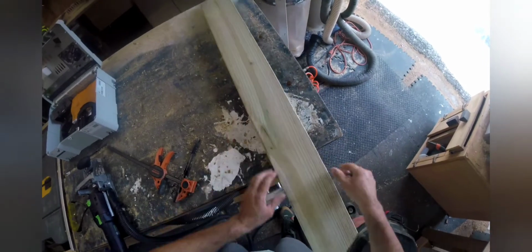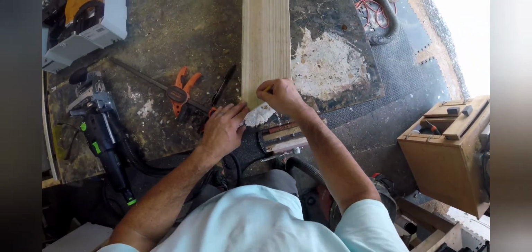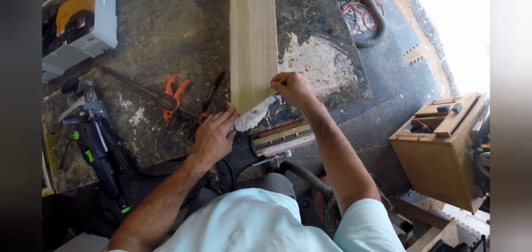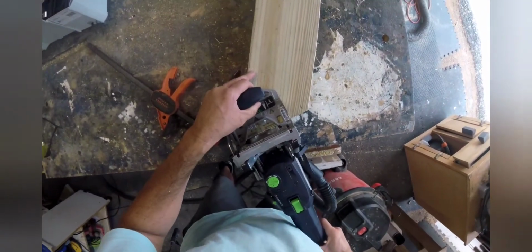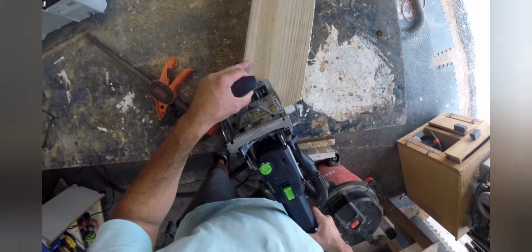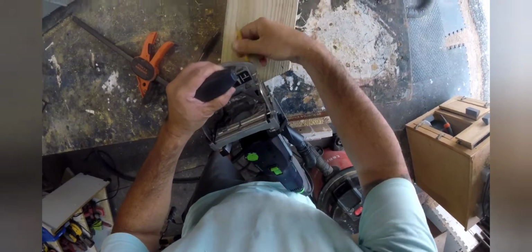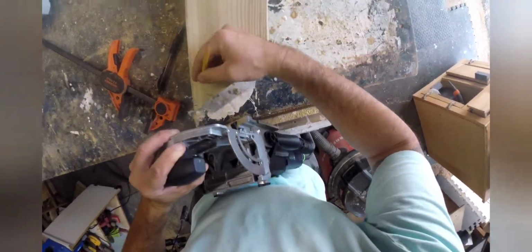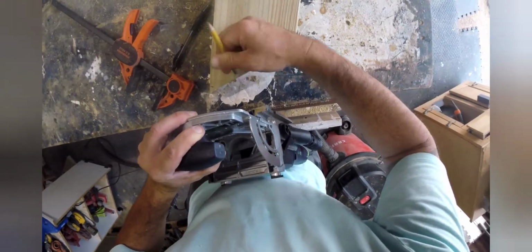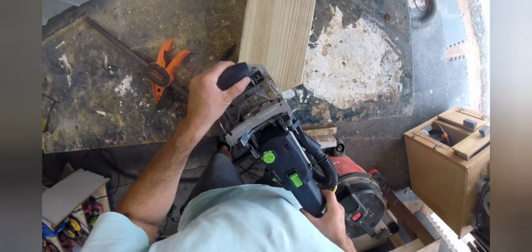I did forget to video this part as I assembled it later. I'm just going to put the dominoes in. I'm going to dry fit it first, but when I ultimately set this up, we're going to be using glue and these dominoes, and I'm going to have the top stretcher, or the top support, in first, and then we will be putting this into the bottom and just joining them together. Unfortunately, you can't really clamp it. I don't have clamps long enough.